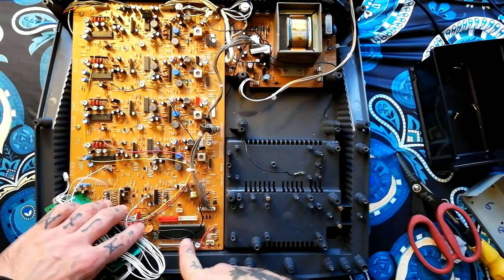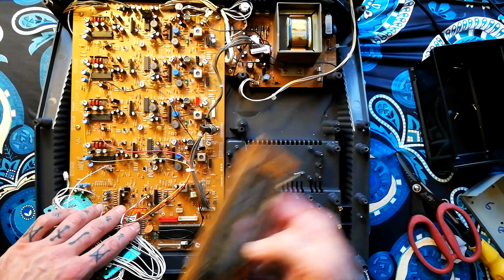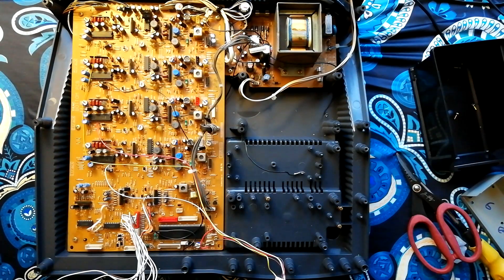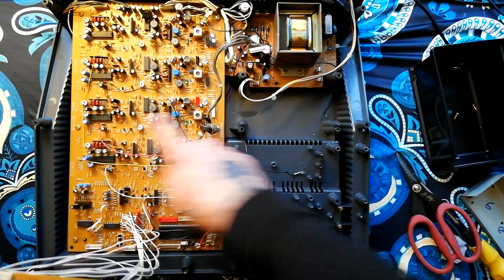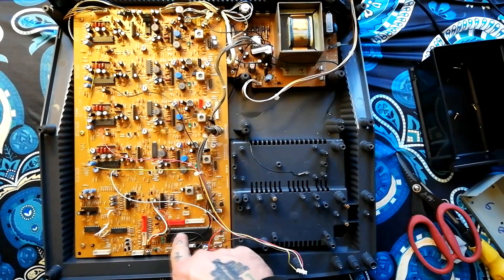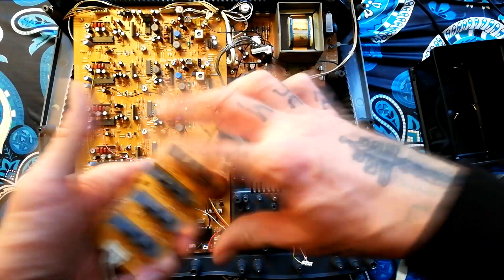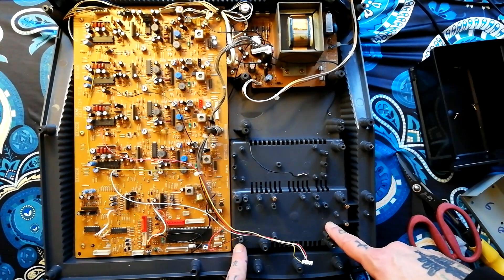There's a large red and white plug immediately above this large black integrated circuit. I assume this has got the little computer program in it that controls how this digital display works. We've got one plug that disconnects on the track arm going off to four different points on the bottom board — looking for relays, or maybe there's just some logic built into these chips controlling whether the signal is hitting the tape in record mode. These two cables near the large integrated circuit connected to the display are probably sending visual feedback about the state of these switches to the screen, as opposed to actually controlling the circuit.